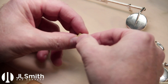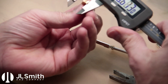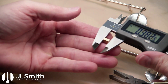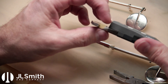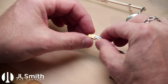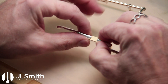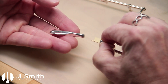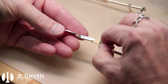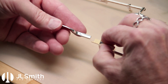We've made these little brass pieces to be a little wider than our widest key, a little taller than our tallest key, and we've got a three hundred thousandths step in here so that when we reinstall it in the key, we've now moved this touch piece three hundred thousandths north on the flute. And that's the dimension I got after consulting with the customer how far she wanted the cluster keys to move north.